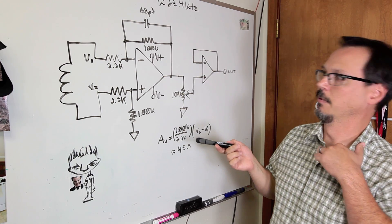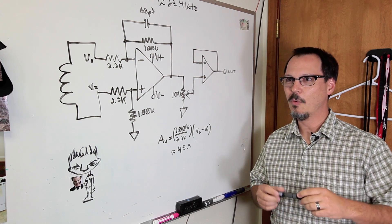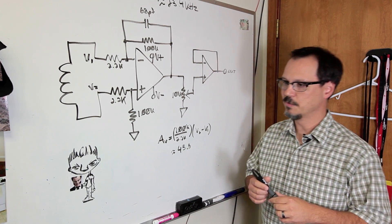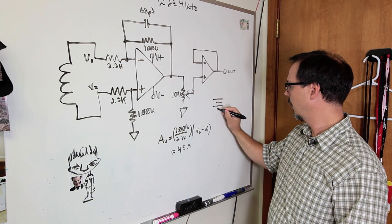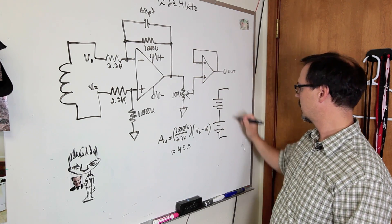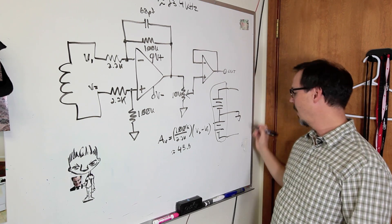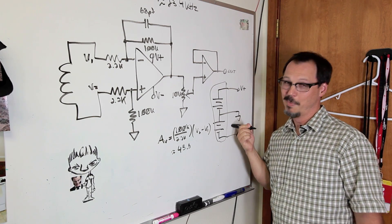The next question is: how do you set up a bipolar supply? I went to our storefront and got one of these little hobby lithium polymer two-cell LiPo batteries — one of the high-current output ones. That thing has a charge jack with basically 0 volts, 3.7 volts, and 7.4 volts. So you've got two cells connected, and using that charge jack you make your ground from the middle pin, your V-minus from the low pin, and your V-plus from the high pin.